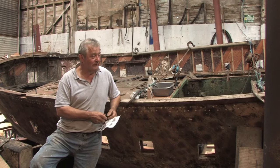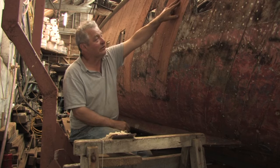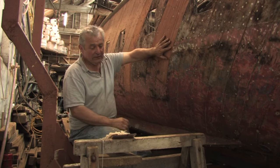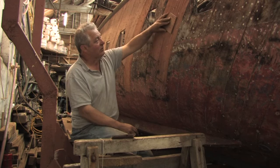Here, we're on the after port section of the boat. These two planks here that were damaged have been taken out. All these nails are the copper rivets that are through. The hull is constructed out of two types of planking. It's all mahogany. On the inside, we have a 6 mm thick piece of ply. It's a mahogany that goes across that away. And then after we put that layer on,